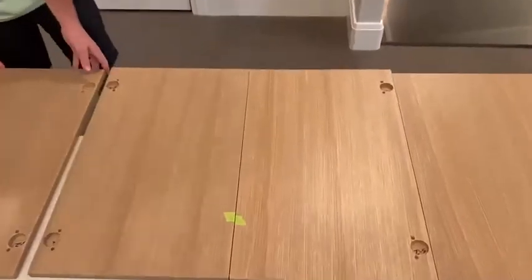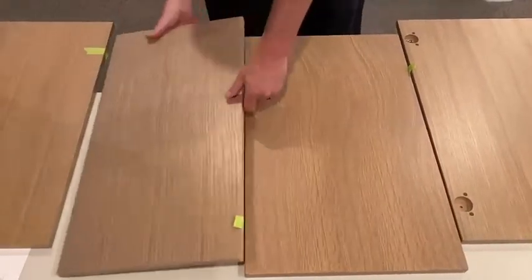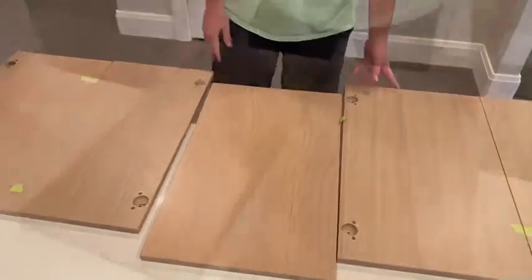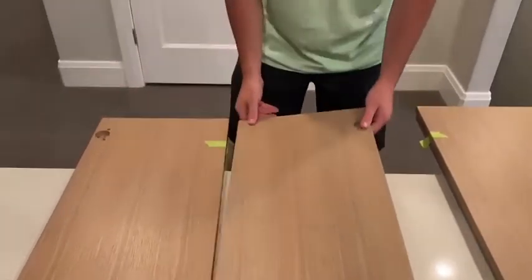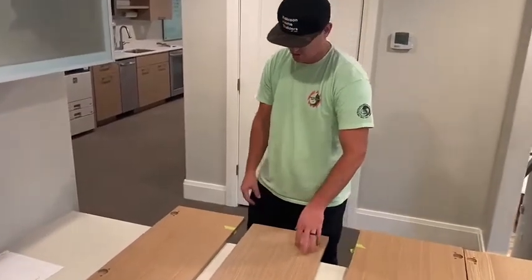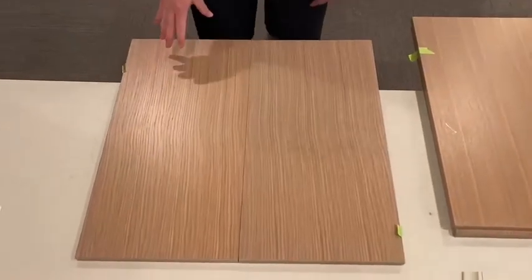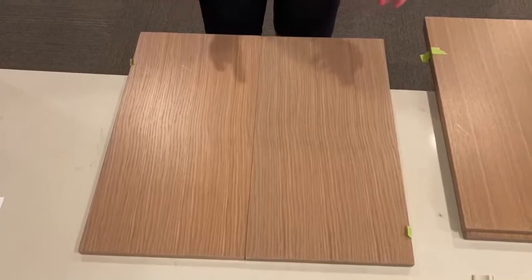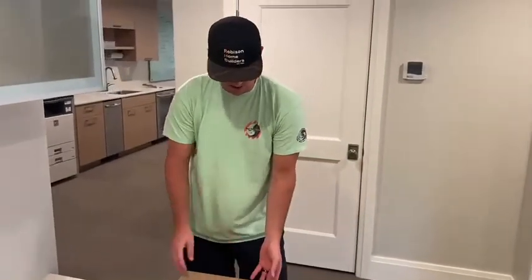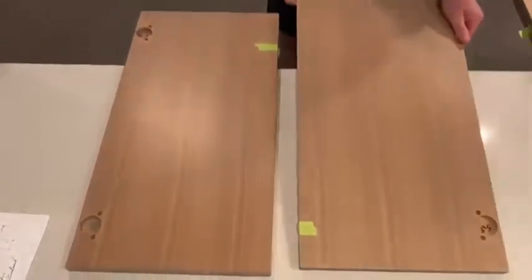Similar on this one — let's see what we're dealing with. One of these doors — let's see what the other side looks like. You can see that it almost looks like more of a plain-sliced oak. Chances are that whole sheet was like that and that is going to be a B side. It is a little bit of a linear patterned plain-sliced oak, so it does make it hard. But anytime you see something like that, always check both sides and pick the more optimal side.